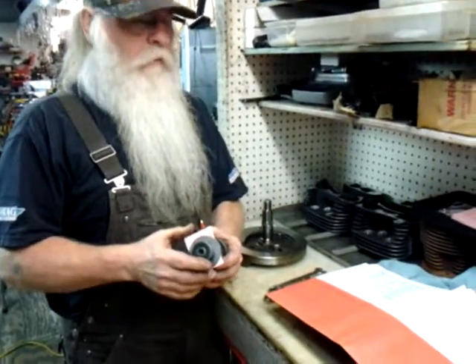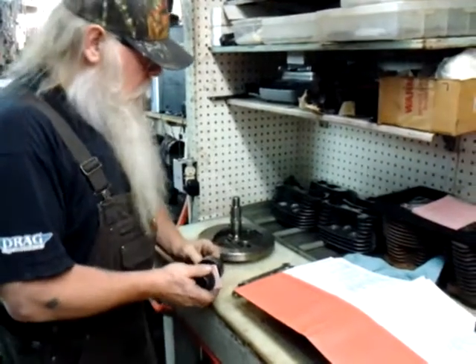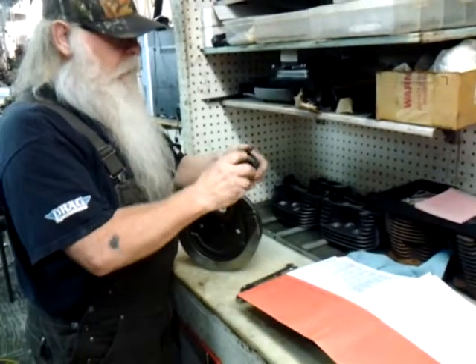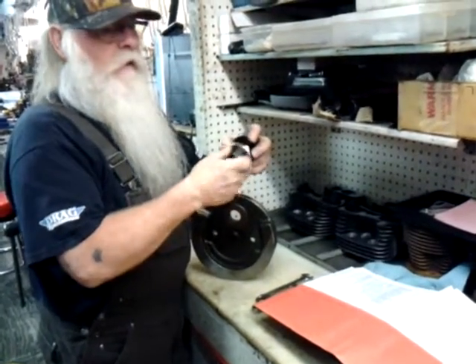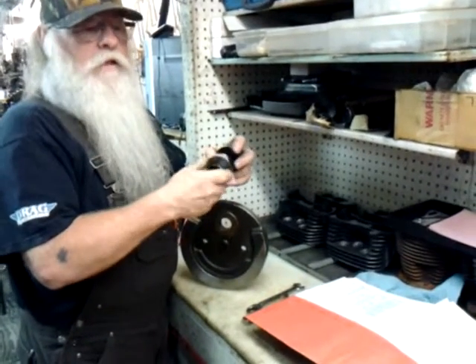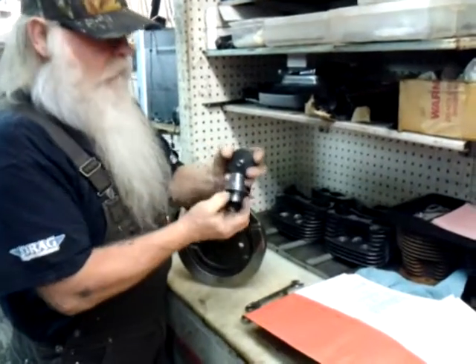I just like doing it that way because I've built lots of engines in my life — a lot of them. Every one's been smooth as silk. Apparently that's the right way to do it, so that's the way you keep doing it. The next part is we're going to attach this bob weight to a flywheel — you do each flywheel of course. What this does is it simulates mass going down the road at about 60 miles an hour, perfectly smooth. That is what the simulation is here.